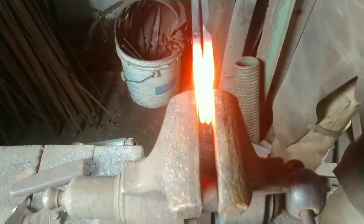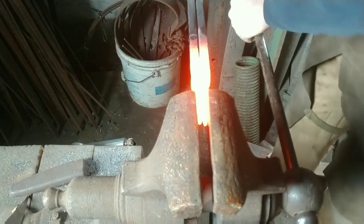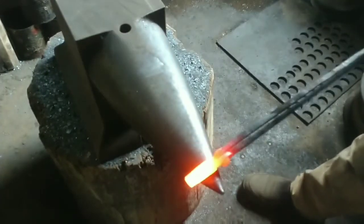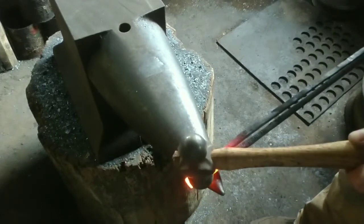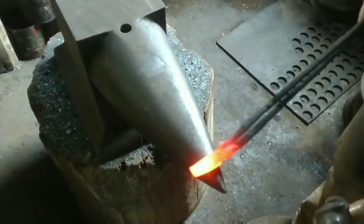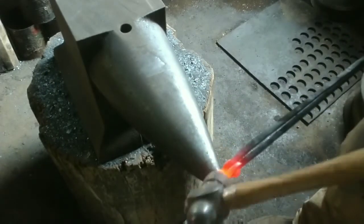I do rivet hot, and then I'm going to set the jaws close. These jaws will be close, and I'm going to give them a little bit of a wave here, because I don't know what type of boot this person will be putting on. I don't want to serrate the jaws because we wouldn't want to damage a dress shoe or something like that.